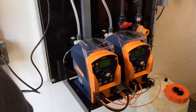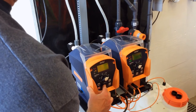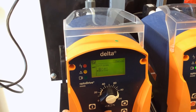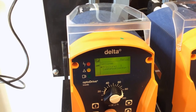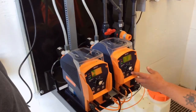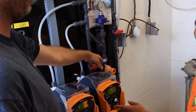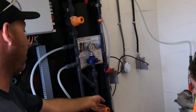P plus alarm. That kind of doesn't surprise me, that one pump will do it, the other one won't. So, I'm going to change this guy back to 3. I knew that we were very close. Keep them both the same? Yeah. Okay, so ignore the thing you said about the P plus alarms. Even still, you might get a P plus. In that case, this isn't relieving at a low enough pressure. To check that, you're just going to close it and deadhead the pump and just see what happens. If you start going above 160, open your valve back up, and you've got a plug somewhere, probably in here.